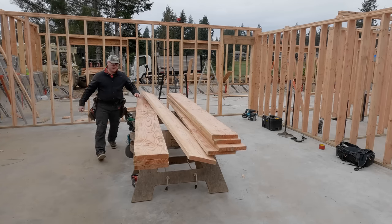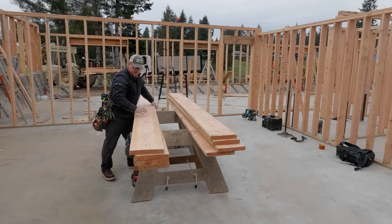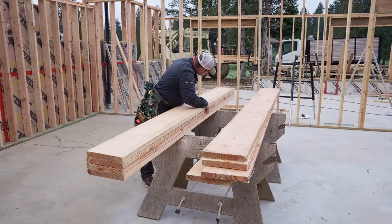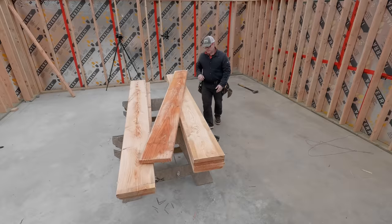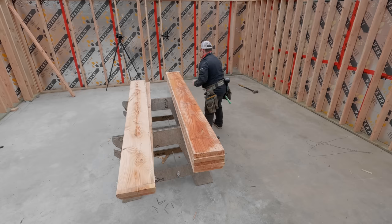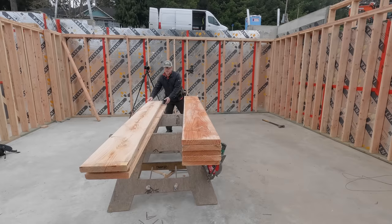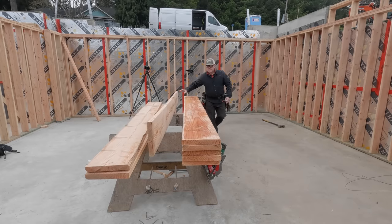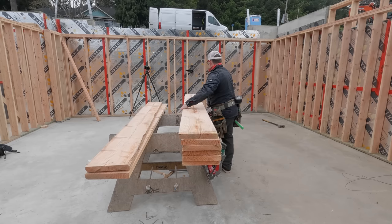Again, crown that way. Okay, not bad. I don't know if it's clear in the video. Bottom 3 pieces, I put a 5-inch screw in. Then I go 3 more pieces, 2 more 5-inch screws. That clamps 6 pieces total together. Then I'm gonna put the top 2 on because I need 8. Same thing, 2 more screws. All of those holes are gonna help me later to align things as I take them apart to finish the cutting.